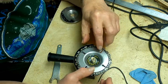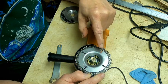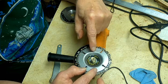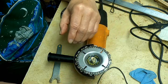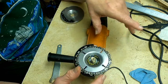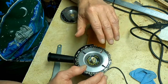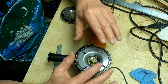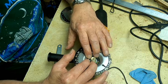And I immediately had a problem. These things work really well. They work, in fact, I feel, too well. They just want to pull themselves right into the wood. They'll pull themselves right to the hub if you let them. It's just really hard to control the depth of cut with these things. It's just a battle, and I almost messed up the bowl.